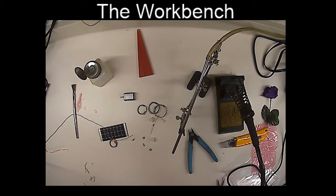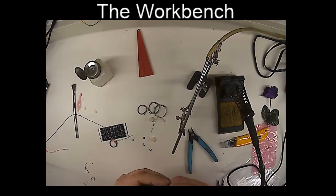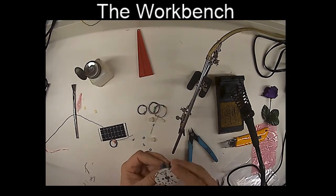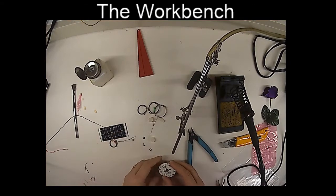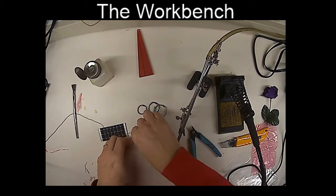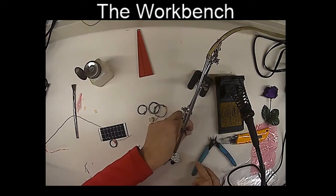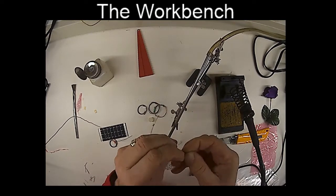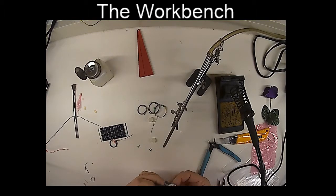The animal is going to have its little motor facing down instead of up. So the motor would be placed in like this, and I rotate the motor till the 2 screws are visible in the holes. And there's a couple little screws that we're going to have to set up. So here's a screw. Excuse my big fat fingers. Put the washer on the screw. Put the motor through the hole. Line up the screw holes.